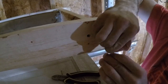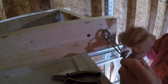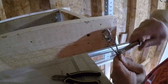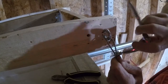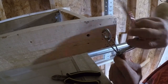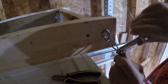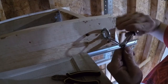Now going to the front end of the tire rack — same deal: put the clamp on, go through that eyelet, feed the wire rope back through the clamp, then take the 8mm socket and tighten everything down. I do want to stress that I end up using two to three clamps per loop of rope, so every time you see a connector there will be another one going in there as well. The second connector is from Lowe's — not the Ever Built ones. The brand I got from Lowe's was Blue Hawk, and I didn't have a single nut strip out, but on the Ever Built I would say 10 nuts were completely destroyed.